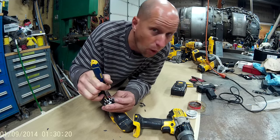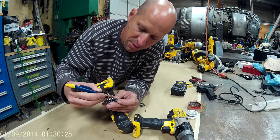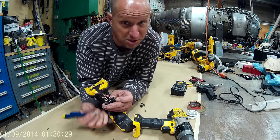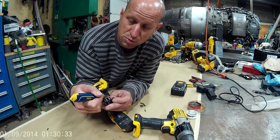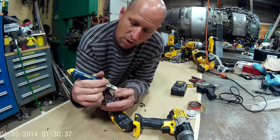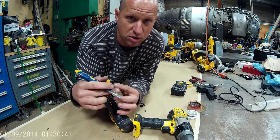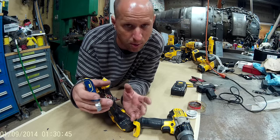It'll work for a while and you'll think the pack is loose — maybe if I tape the pack in it'll work. And it just gets worse and worse. Because sometimes the insulation around these two small wires kind of holds the wire together. So as it works back and forth and finally breaks, the insulation serves to hold the ends of the wires together. When they're touching, that's when it works. When they come apart, that's when it doesn't.